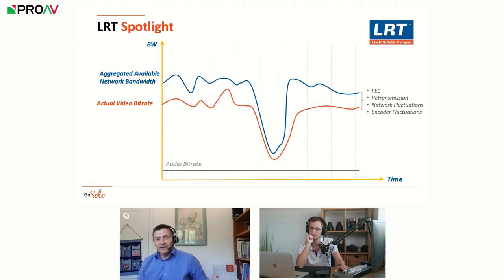I think the next slide is showing a bit more detail about the idea of the jitter buffer. So within the unit you have a total aggregate bit rate, which is made up of the network connections that you're using, and we're basically doing a round trip. Packets go to the cloud, packets come back from the cloud to the unit to measure that throughput, and the unit's using that adaptively to decide at what sort of encoding bit rate it's encoding.